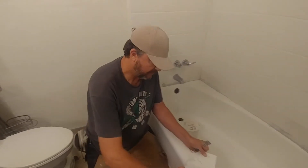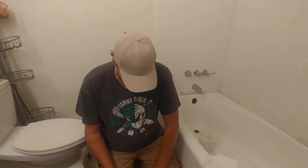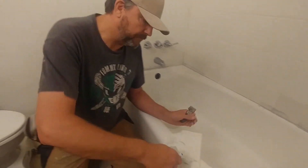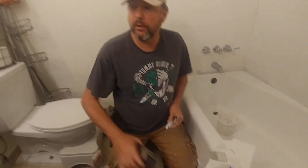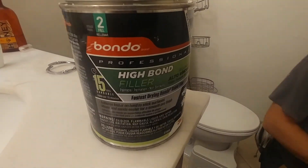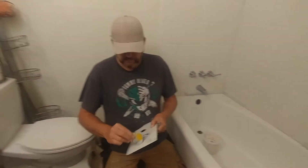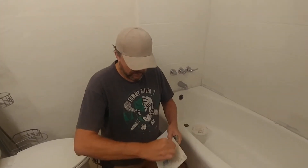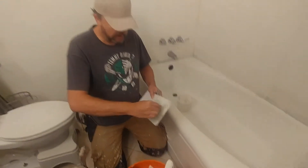An alternative to grout, especially in the tub industry — you don't have time for the grout to dry, and then you can't seal the grout and spray over it. So I'm going to show you a little technique I've developed. I'm taking some Bondo from Home Depot, but you can use any Bondo. You want to get the stuff that's going to harden up, get nice and hard and not be really soft. Bondo's for a lot of stuff — this is an alternative grout because it will dry in a couple of minutes. I'm going to show you how I do this and how you can finish it off without any sanding — just use an eraser.